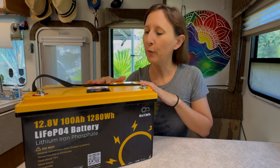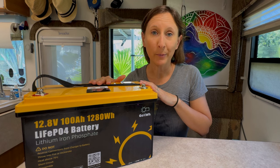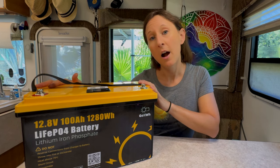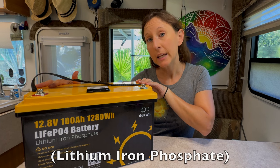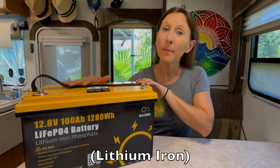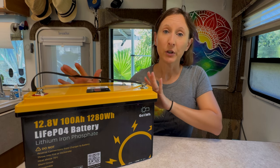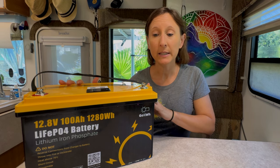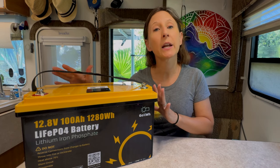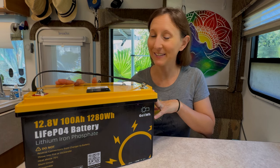You can tell if your battery is going to overheat — it's got a temperature gauge, tells you the voltage and the amps. We'll run through that later in the video. For now, the basic specs: this is a 12-volt 100 amp-hour lithium iron phosphate battery. Lithium iron phosphate batteries have four times the cycle life of a regular lithium battery, so it should last longer and be a bit safer. It has a built-in BMS system to ensure safe operation, and they're claiming about 4,000 cycle lives over a 10-year lifespan.